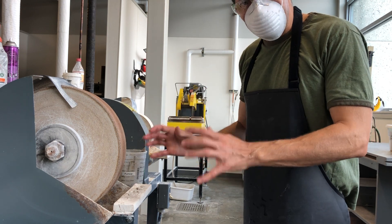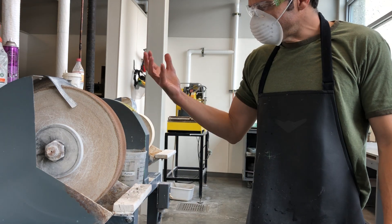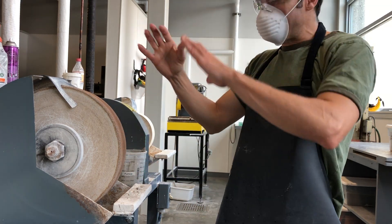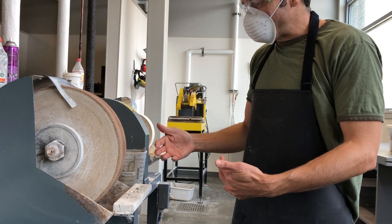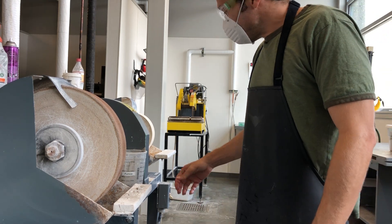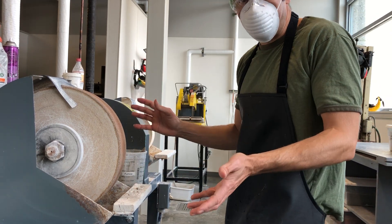Let's talk about how to shut this equipment down properly. As you can tell, it has absorbed water a little bit past the surface. We don't want to shut the machine off immediately if it has absorbed a lot of water. What happens is gravity takes over, or the air currents in here dry off one part faster than the other, and one part shrinks more. Then we end up with a wheel that's not actually round — it's more like a football — and when we go on it to polish stuff, it's bouncing everywhere. That gets to be really dangerous and hazardous. So we want to make sure that we leave it on the entire time after we have finished using it, and it will dry off — we let it air dry by spinning.